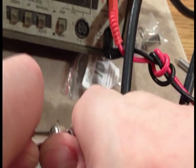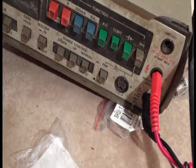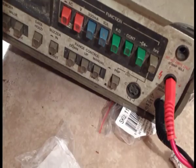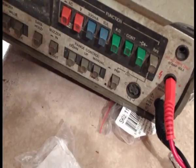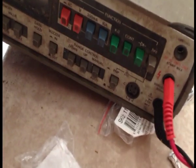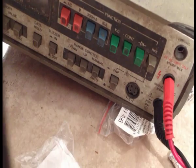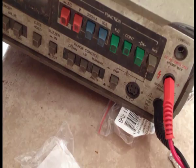Now, if you ever get any BNC connectors and you want to recycle them, you really can't do it with these because they're not recyclable. So again, let me buzz it. Make sure there's no shorts. So just take the center probe. Okay, good. Now take the other end. Make sure the connections are good on both sides. Center pin and braid. Okay, center pin's good. Braid's good.